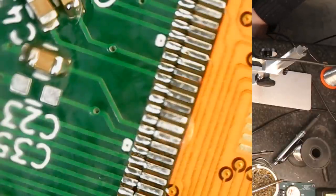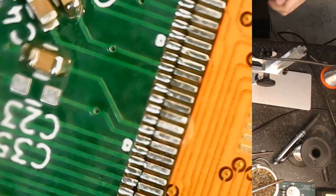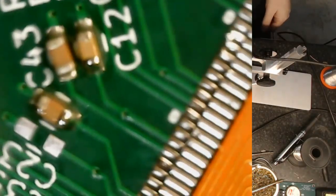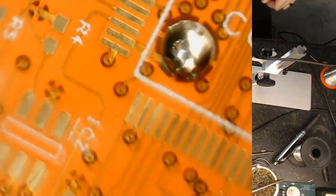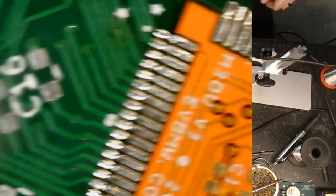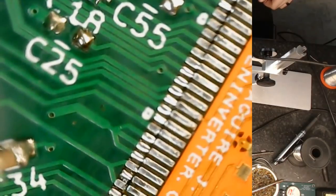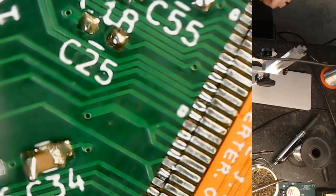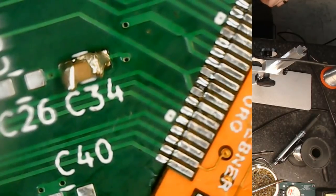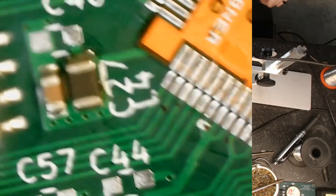All right folks, so I've gone ahead and soldered up all four sides. That took about 5 minutes, once, as Louis Rossmann would say, I used the right amount of flux. I've just cleaned it off with some isopropyl alcohol, so it's still a little bit wet from that. But this little baby so far has soldered on there absolutely perfectly. I got absolutely no bridges with this. It just drag soldered absolutely perfectly.